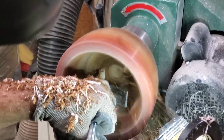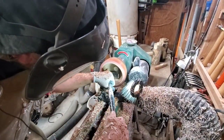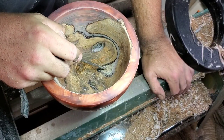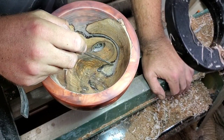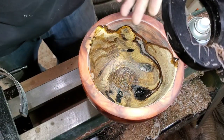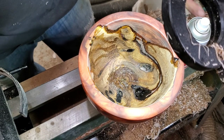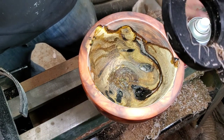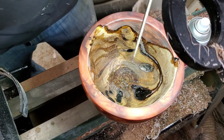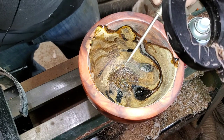At this point I'm just about done with my hollowing, so I stop and fill any little pinholes on the inside with the black Star Bond. But what did I find? Another rock on the inside, in a different location from the one on the outside — a second rock in this damn bowl. I fill my pinholes, I tried to put CA glue on the rock — didn't work of course — and I start my final scrapes to level off the CA glue and get rid of any tool marks.